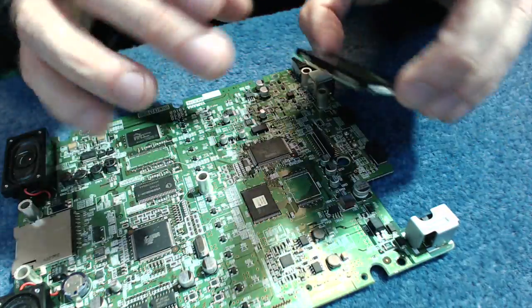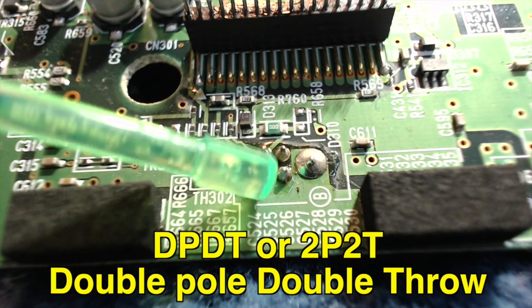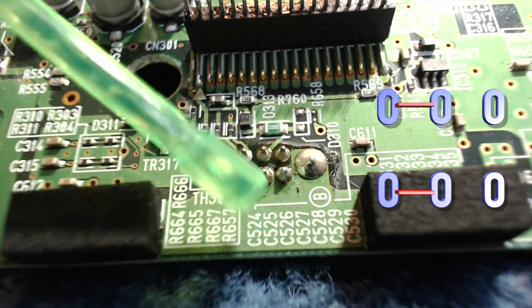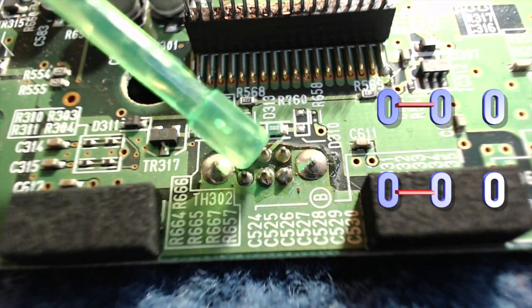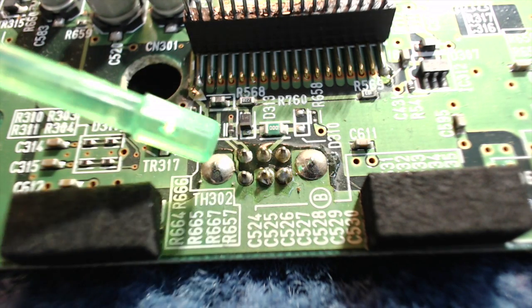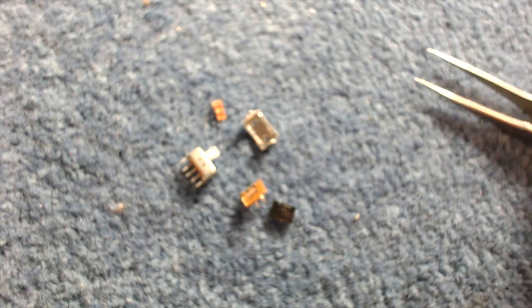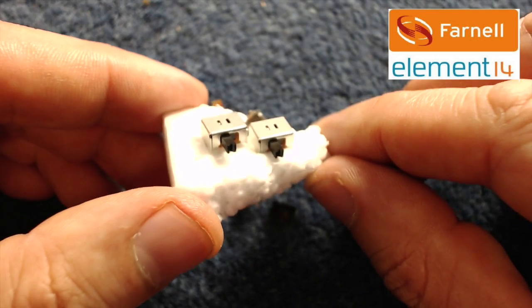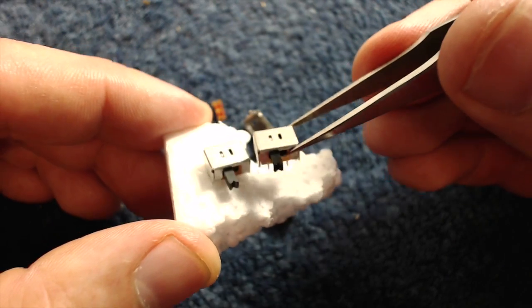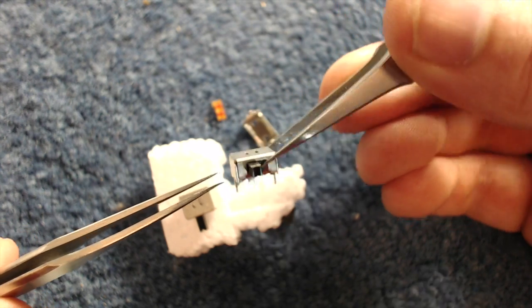Now I can get to the bottom of the switch. It's a double pole switch — when you slide it across, it connects one side to ground and connects the other two contacts as well, so there are two switches in one. I thought I'd get away with a single switch but I'll have to do more digging. I've been on Element 14, which is a Farnell site, and I found these replacements — they're about a millimeter shorter across but the pins line up, so I just need to bend the outer pieces out slightly.